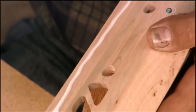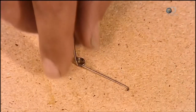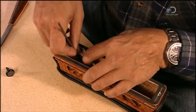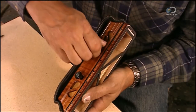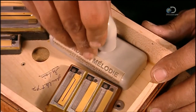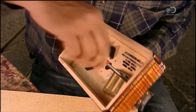On the outside, a decorative wood inlay — a strip of ebony and some rosewood detailing. The left-hand keyboard has two buttons corresponding to three reeds each, producing two bass notes and two chords. After staining and varnishing, he hooks a spring between each valve and its button, adjusts the spring tension, checks the air seal, then stamps the company name inside before screwing the finished keyboard to the wind chest.